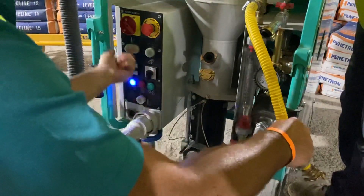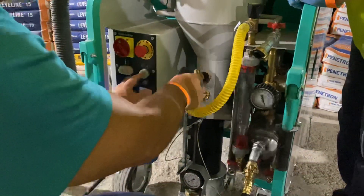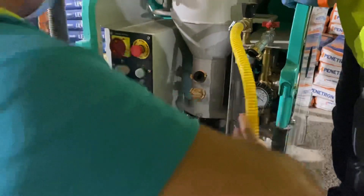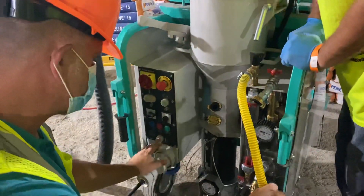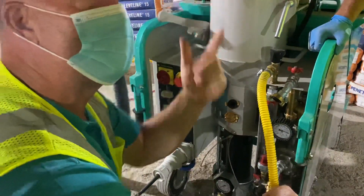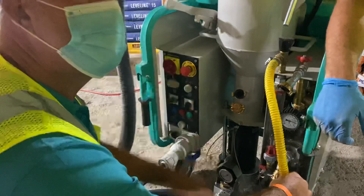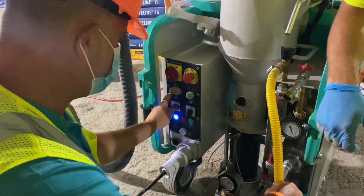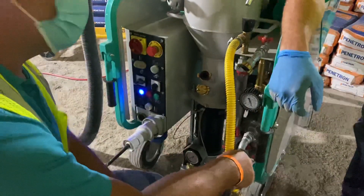In the morning when you come to free the rotor/stator, if you hit it dry it's going to make a wicked noise and you'll burn the rotor and stator. What you want to do is put a little water in just to lubricate it. Go in reverse first — reverse is just sporadic hits, there's no reason to let it spin in reverse continuously. Just tap it, see it free up, then go back to forward and hit it — now you're pumping.